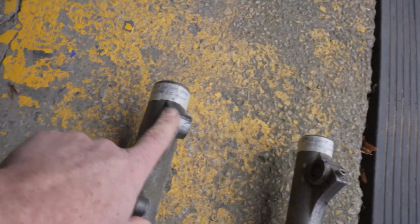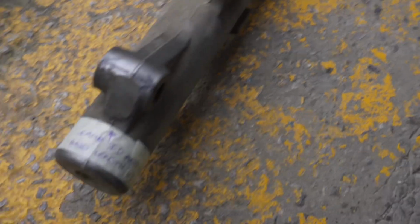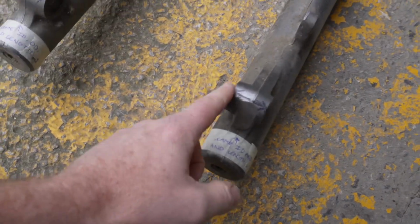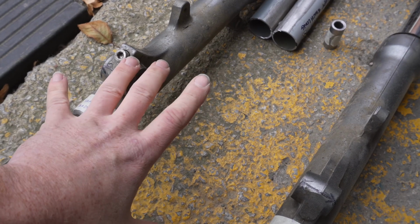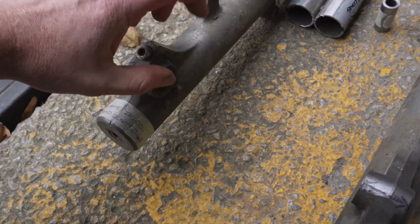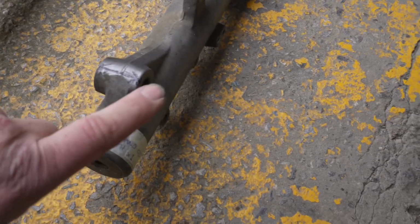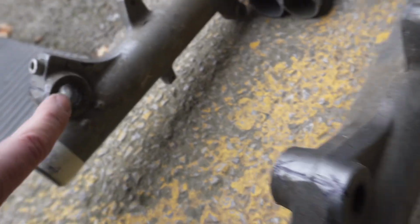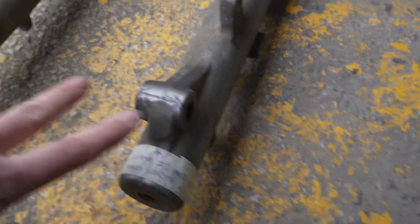And then I also need, these are the Bergman forks that we don't need anymore, but obviously we're using a Bergman wheel, so the axle bolt that goes through these we're going to be using, because obviously it's the same for the wheel. So we need a set of pipe to weld on the end of our swing arm, same as these two, and they're actually different internal diameters each side. That's a narrow one and that's a slightly larger one. So I'm getting him to make a pair of these as well.